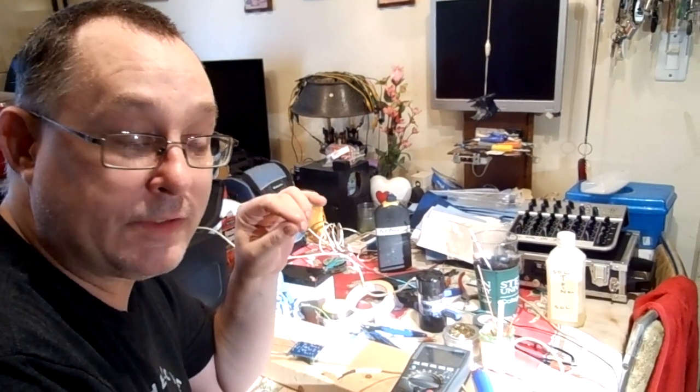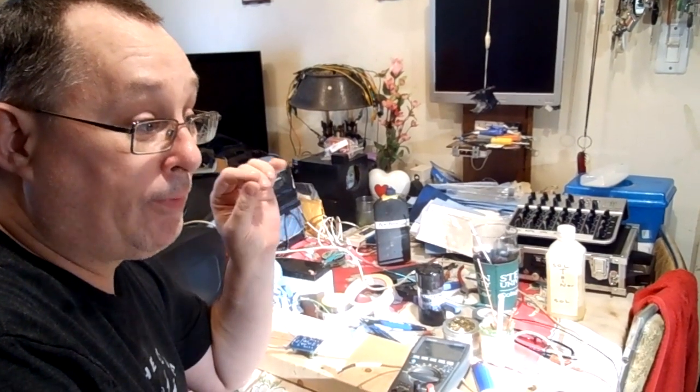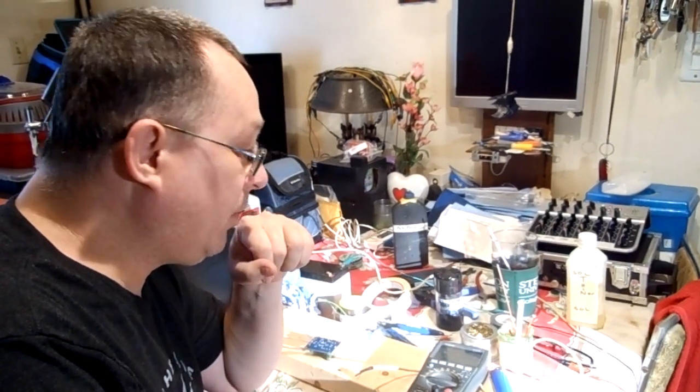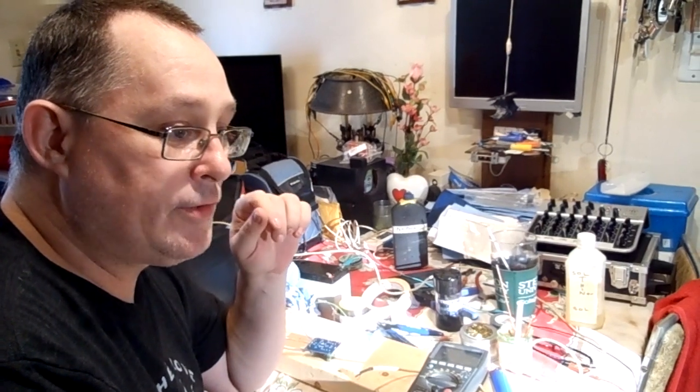The most important thing is that you're using some type of flux. And this is what the pros, techs, and experts won't tell you. They won't tell you that 9 out of 10 things, I mean, if you just stripped 2 wires and you've tinned them already, you don't really need flux, but I use it on everything.